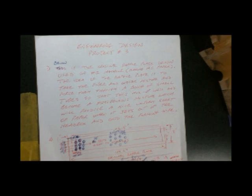Let me give you some background. Below you'll see a sketch of the original baffle plate, which was used on number one machine. We had made very fine paper on number one machine — machine glazed paper used in a lot of food industries, so food wraps. The idea of this baffle plate is that it takes fiber and water and creates vortexes and speeds up that mixture, forcing it to mix up a little better. It's done by forcing a large volume of liquid through a bunch of small tubes, making them more homogeneous — more uniform in their mixture — and we end up with a nice uniform sheet of paper formed out on the head box, jetting out onto the forming wire.